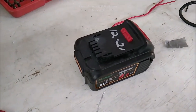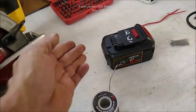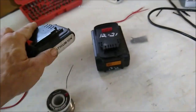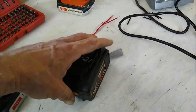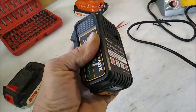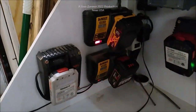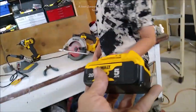You've seen the little test so you can check whether the BMS has failed based on the indicator light behavior. Most of the time if a battery cell has truly failed you're going to see some real deformed effect on the cell cases. If they're not deformed and they're not smoking, take them apart and see if your wires may just be loose. The DeWalt is already charged — we'll pull it loose and give it a shot.